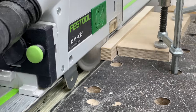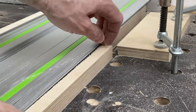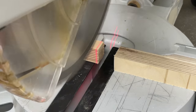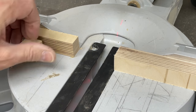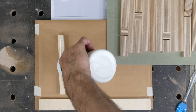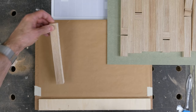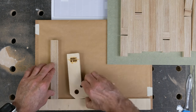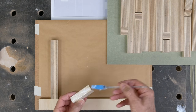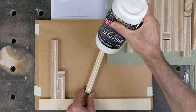For the final pair of drawer fronts I'm using what's left of the 25mm plywood offcut and cutting it down to 18mm thick staves. I've drawn up a vertical design that has the occasional break with a 25mm piece of stave running horizontally, then I can glue them together to make that pattern. It reminds me a little bit of dead pixels that you used to see on computer screens - it breaks up the sameness without making it look too busy. I've put grease proof paper or baking parchment down to help prevent the staves sticking to the backer.